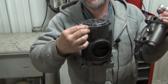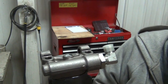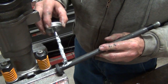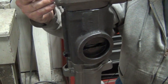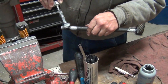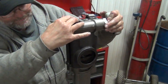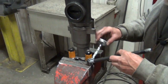Make sure your rubber seal is still there. Line it up, wiggle it around, and it should pretty much drop right on. When you put the side rod bolts in, nobody likes anti-seize because it gets all over you, but if you have to take this drill apart two years from now, you'll appreciate a little anti-seize. There'll be an area where it's kind of concealed and then down here, and also on the thread — so hit a little bit here and a little bit on the threads.